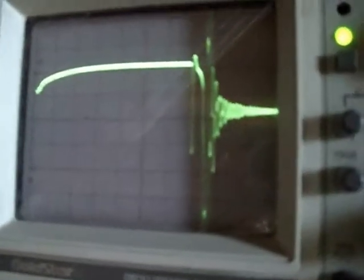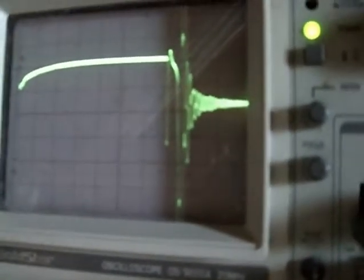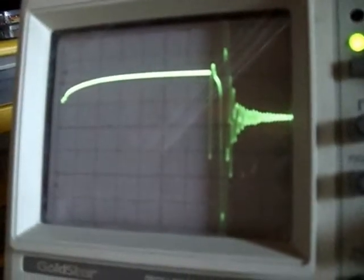Here's what the circuit looks like when there's zero resistance at the gate. What I've tested is that no resistance at the gate leaves this really chaotic ringing where you get the negative spike but then you get all this chaos right here. It leads to actually less heat in the resistor for equivalent voltage and current, and even less battery charging. So the three general stages of tuning the gate: this is no resistance.